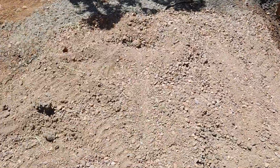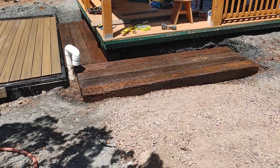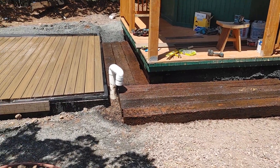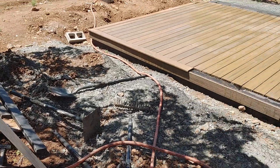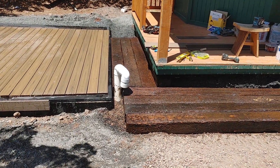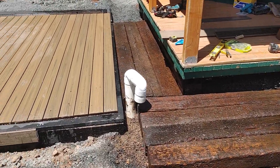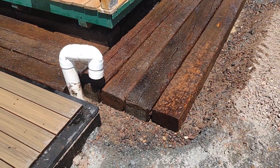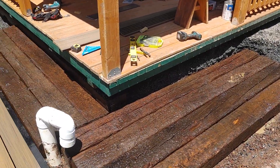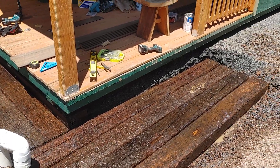I'm also going to create — since this is all the compacting rock and gravel that the concrete guys used and had left over — I've put that in there and compacted it with a flat-headed compacting manual tool. I'm going to take rapid set concrete mix slurry and make five-gallon buckets of water cement. I've already got all my fills and sand and gravel in place, and I'm going to pour it in between all those cracks, wash it off the top, let it sit and set up. There's more than one way to pour concrete.